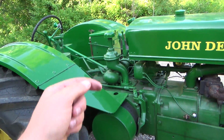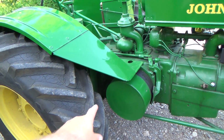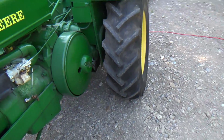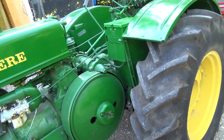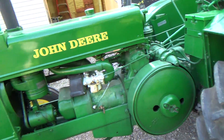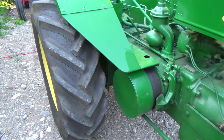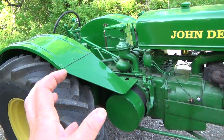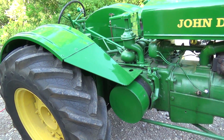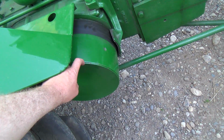It's leaking oil past each crankshaft seal, I know that, which sucks because to get the whole flywheel assembly off, you got to take the wheels off, and that sucks. So to get into those crankshaft seals, and apparently the crankshaft seals in this are a piece of cork. That is it. I don't know if there's some new retro thing, some sort of seal that we could plunk in there, but yes, it's cork. That's very corky.